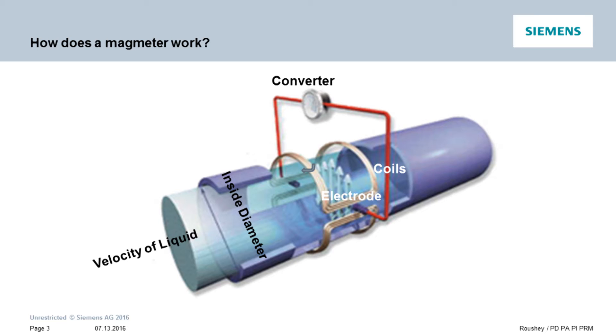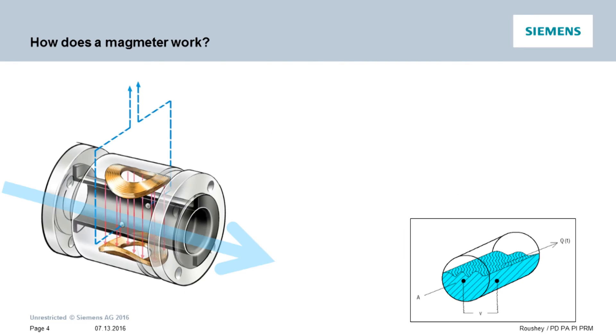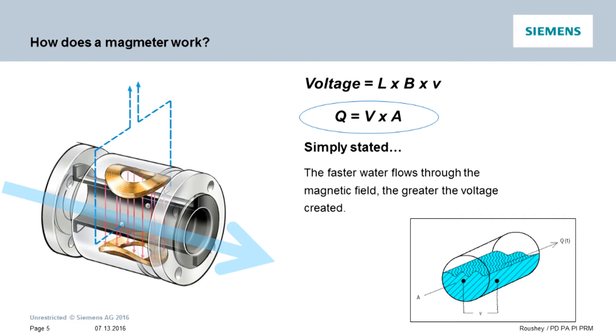Let's take a moment to review the measurement principle used in the electromagnetic flow meter. Simply put, when a conductive material flows perpendicular to a magnetic field, it will induce a voltage that is commensurate with velocity — the higher the velocity, the higher the voltage. By knowing the velocity, we can then determine the volumetric flow rate through a fixed diameter pipe. As long as the minimum conductivity threshold is met, the technology is immune to changes in the conductive property of the fluid being measured.